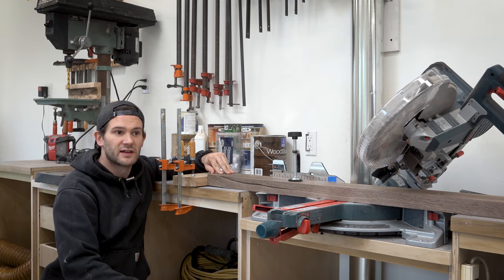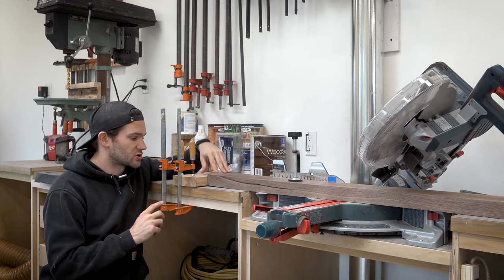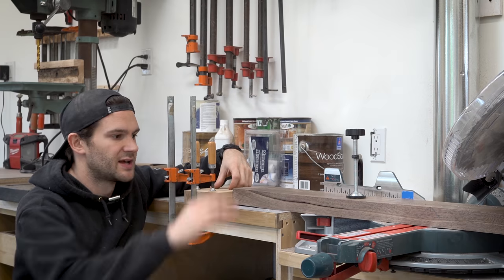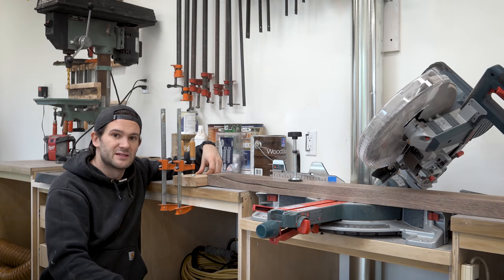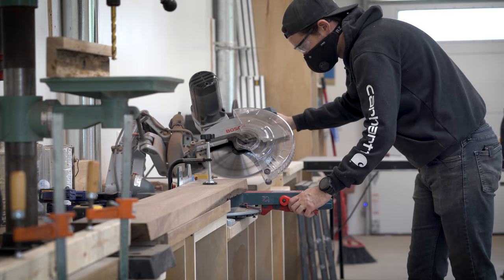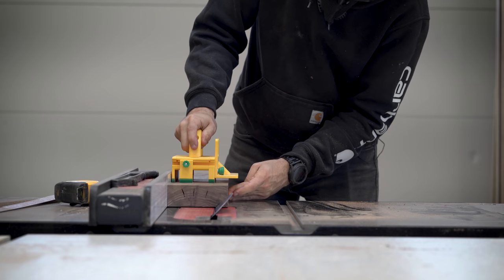Here's the conundrum: originally I was planning to glue this desk up as one big glue-up, but I don't have a saw capable of cutting an accurate miter in something that wide and thick. So I'm going to cut all the individual pieces into the shapes I need and then glue them into the waterfall shape after the fact — but I'll have to be really, really tight with my tolerances. I'm using a stop block — a cedar 2x6 scrap clamped in position — so every piece will be the same size. The pieces for the waterfall ends were 25 inches long and the pieces for the top were 72 inches long. Then over on the table saw I cut the front reveal.